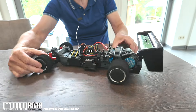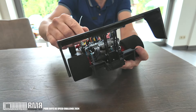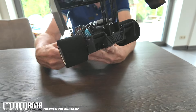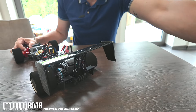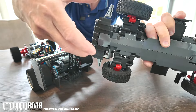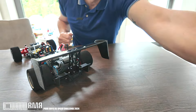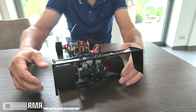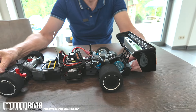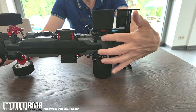Starting at the back: the C11 parts I make include rear stabilizers and alloy wing supports, but they were a little too high for this kit, so I remodeled and printed them in carbon-reinforced plastic. On the bottom you can see the diffuser — modified from the C11 diffuser and mixed in with the rear skid plate and clamping assembly from the Project 959. The whole unit clamps on with two nuts, no holes in the chassis. It should give some ground effect under the motor. The springs have been modified to drop it lower.